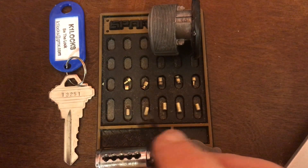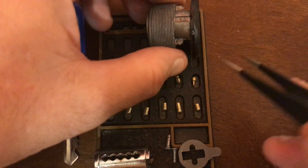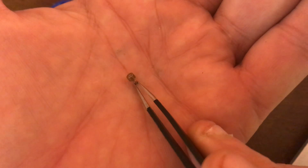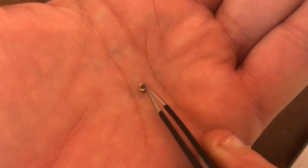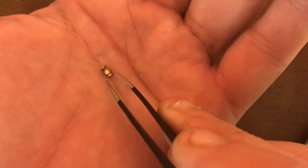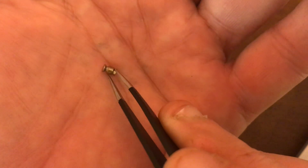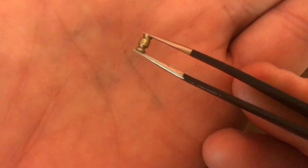There's no modifications on any of our keypins. Now upstairs, this is one I was slightly questioning. But I think this was just by itself — we didn't lose any pieces anyway. It looks like we've just got a heavily reduced little diameter spike here. And when I was opening, it was hung up on that threading inside. I love these guys — nice little barrel pin, that's what I refer to them as. That's probably the closest thing it is anyway. Got a nice little deep cut there on the top. Normally on barrels you find them a little more uniform. It's fine not to do them that way, and it's awesome. Love it. Those are some of my favorite pins right there.